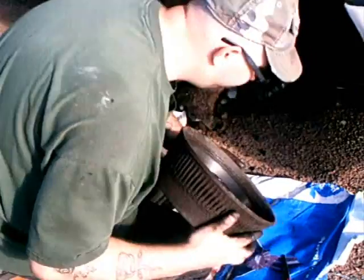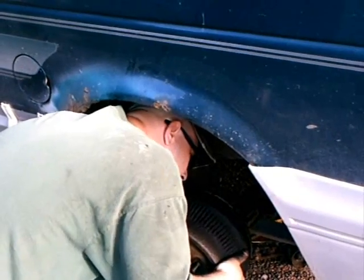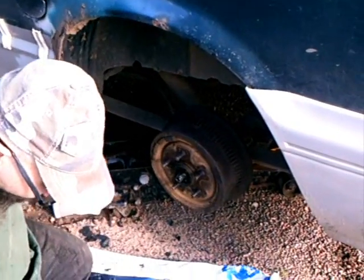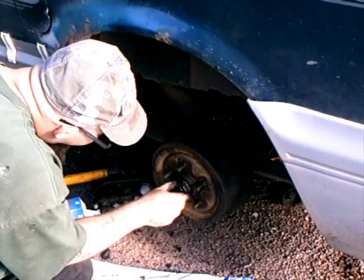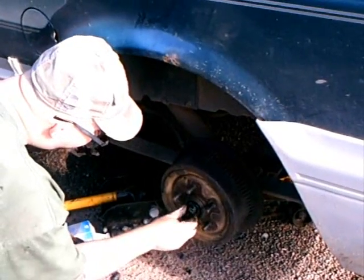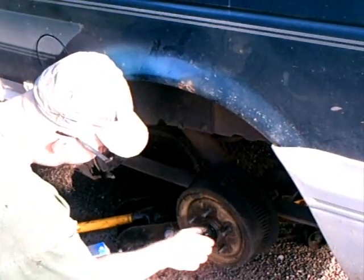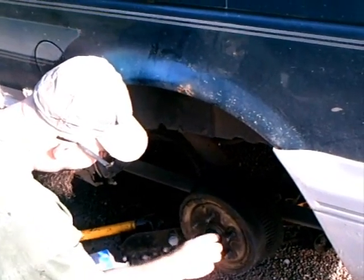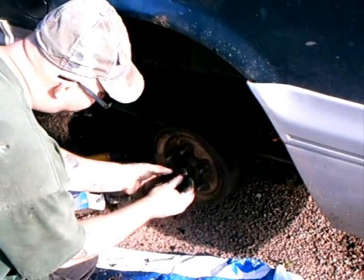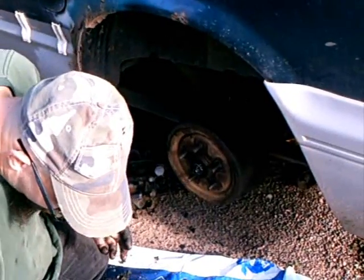The other bearing is already in here and didn't come out when I pulled this up. The front bearing and the front washer has a slot in it for putting on here. The best part about all this is it only has to be finger tight — anything more and I could burn out the bearings. This cap kind of tells you whether or not you've gone too far, because it only lines up if you've got it right in the right spot.